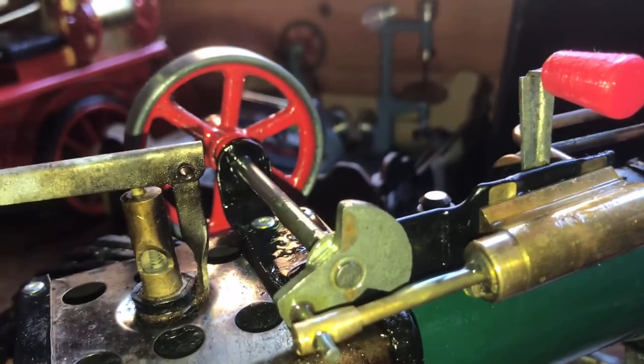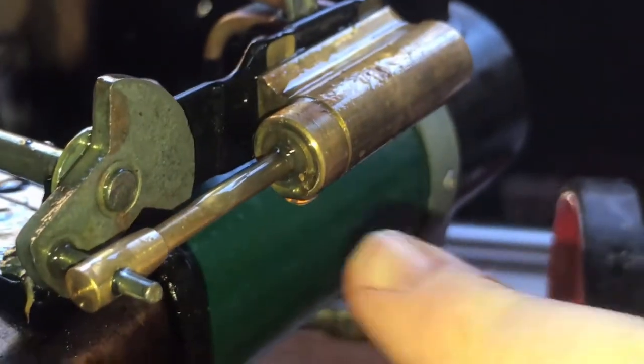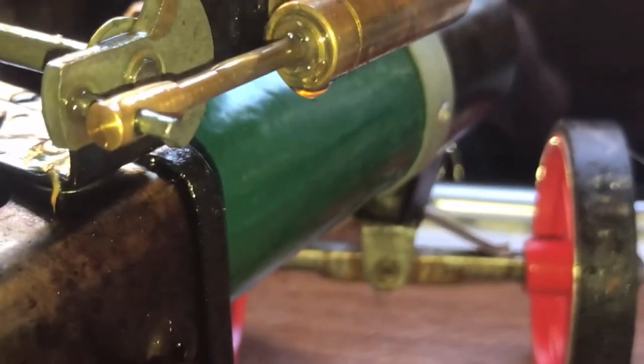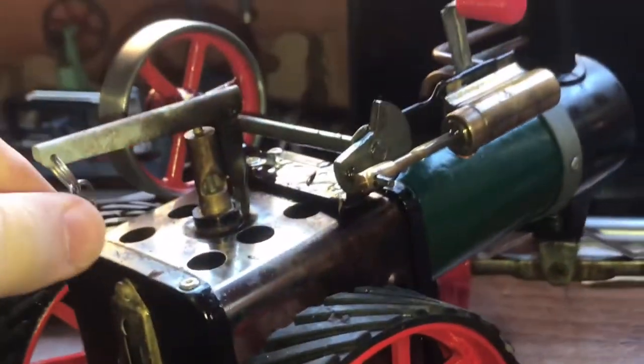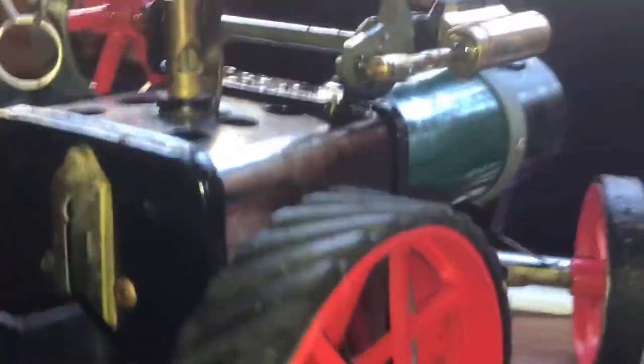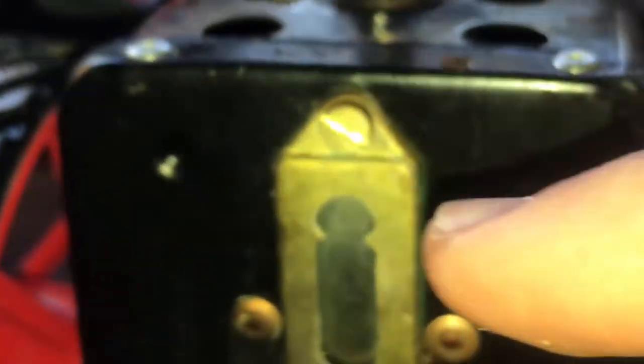So now the engine's going to start building up some pressure, so stay tuned. Then you start to get pressure, but water always comes from the piston. You can see the whistle still can't blow yet — there's a bit of pressure. Make sure we've still got enough water in there; you can see the water level bouncing — that's the level you should do it at. There are little triangles on the side that show you the level.